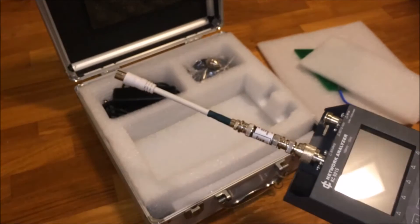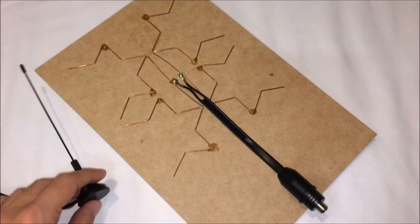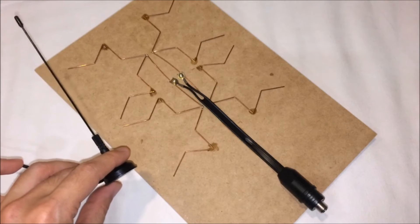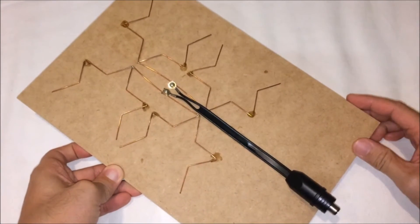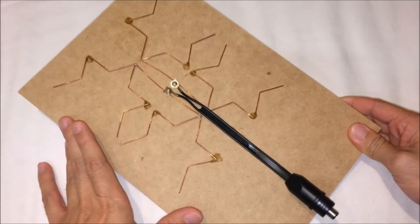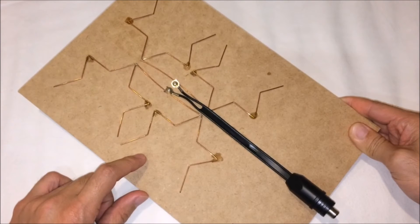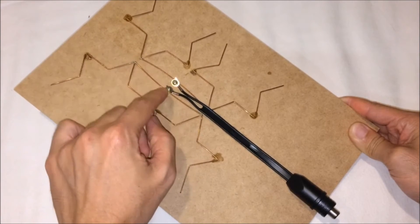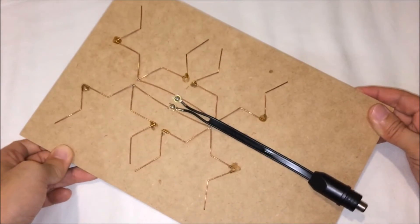For the readings I'm going to measure the VSWR of two 75-ohm antennas. On the left is the stock antenna that comes with the set-top box, which is a receiver for DVB-T2 format digital video. On the right I have the DIY do-it-yourself HDTV antenna. To make this antenna you need a 300-ohm to 75-ohm balun and 18 AWG copper wires. This array of four elements is joined to the two leads of the balun — you can Google for a plan online and find one easily.